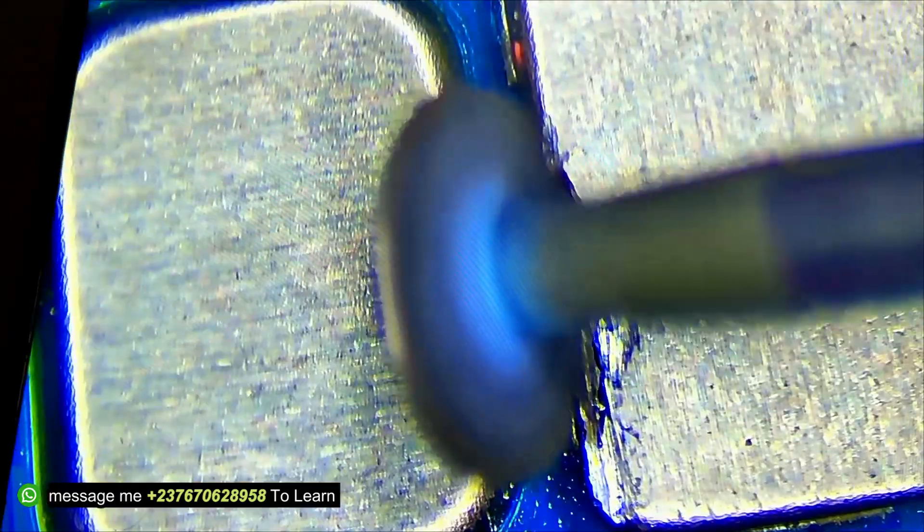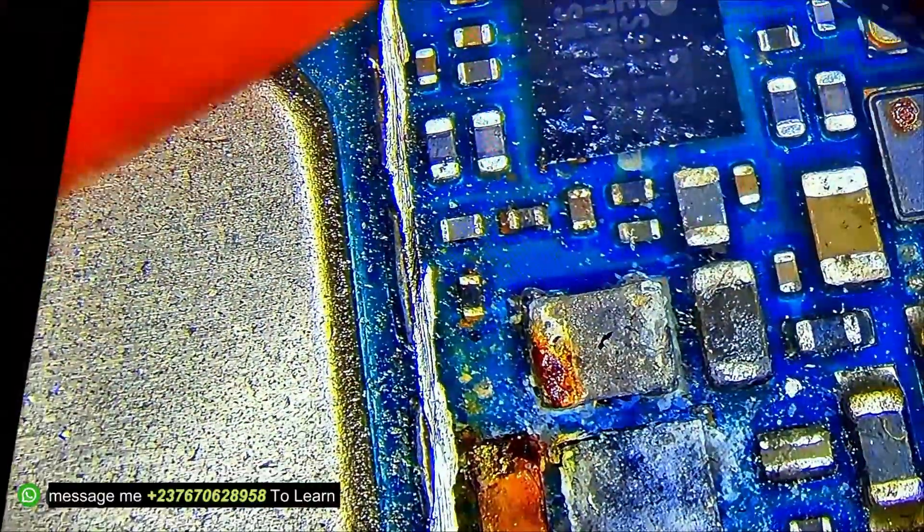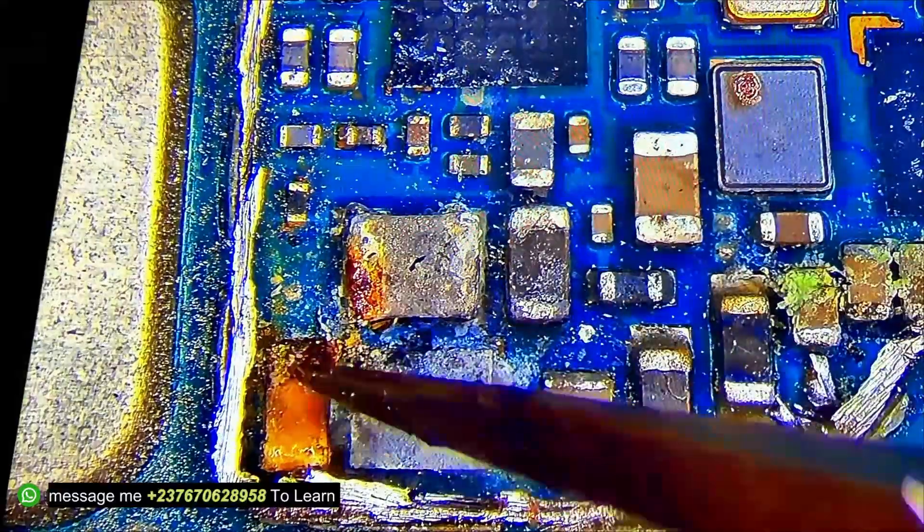As you can see, I injected voltage into the mobile PCB and noticed a lot of heat coming from a different section this time. I had to cut out this area the same way I did before. You need to be very careful when using the cutting tool because just one mistake and the drilling machine can cut out PCB lines. As you can see, I slowly pulled off the shield.